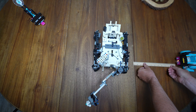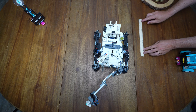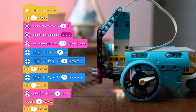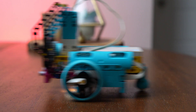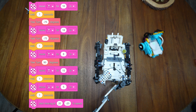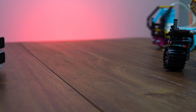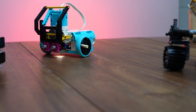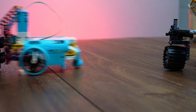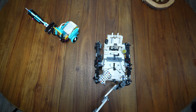If you're completing these missions with no obstacles and fairly quickly, it's time to make things a little bit more challenging. Move an obstacle into the middle of your mission table. Take some time to make your measurements and figure out what yaw angles you're going to need. Then change your code to go around the obstacle. We start by putting our arm up and down just to test that gearbox, then we start to move forward. We do a yaw turn to the right of 75 degrees before driving forward 16 inches, then hang a left and go around our obstacle. Our robot makes it around the rover and is ready to make the satellite go into the upright position, allowing us to communicate back to Earth using those radio waves.